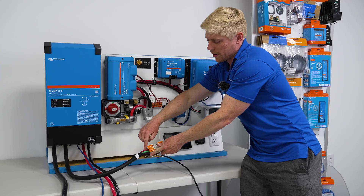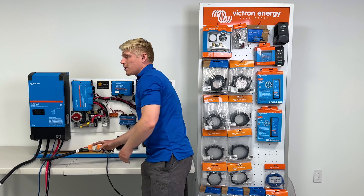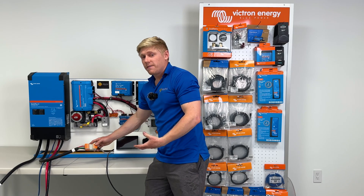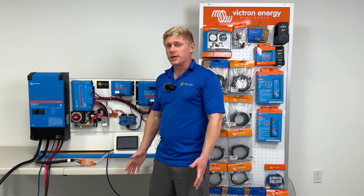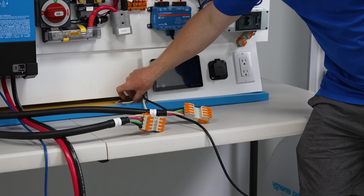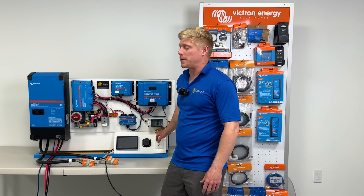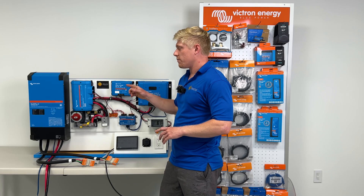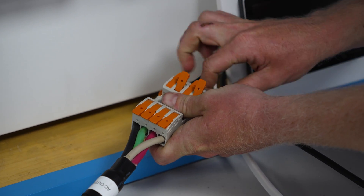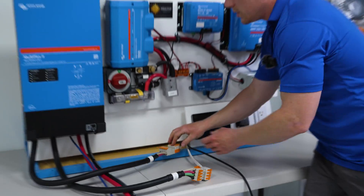Note that I don't have a red wire because I've got a 120-volt shore plug — a 15-amp inlet. Also common on RVs is a 30-amp inlet, which is also 120 volts. If you've got a 50-amp RV, you will have all four wires. Now insert your AC output wiring into the plug labeled AC output on the inverter. For you, those wires go to your AC main breaker panel — a wire you'd run throughout your RV from the inverter to the main panel. With my 15-amp setup today, I'm only using three wires; with a 50-amp setup you would use all four.